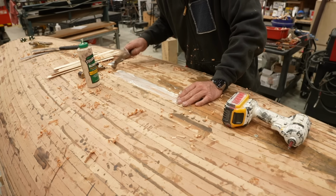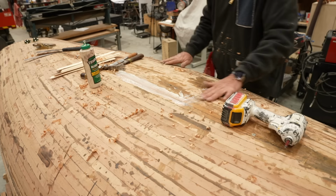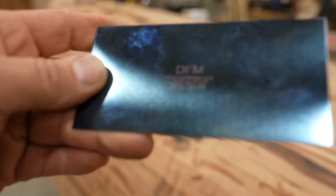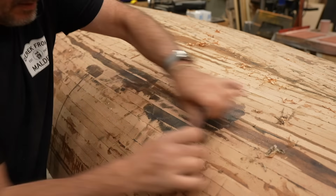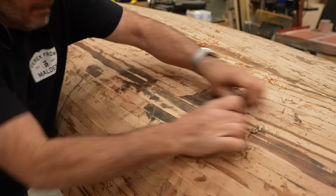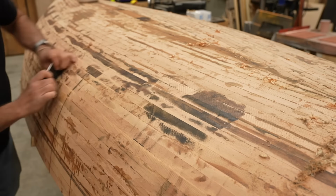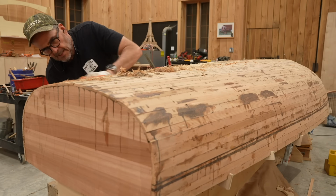Now I started mentioning a squeeze clamp invention that I made for the front, which I don't think I explicitly show, but where the planks come to the very front of the stem, I sharpened both sides of a squeeze clamp so it grabs like fangs, so it pulls the front into the stem. The squeeze clamp has fangs on it so it doesn't slip, because it's impossible to clamp when you're at the apex of a V. It's hard to clamp in that particular direction.